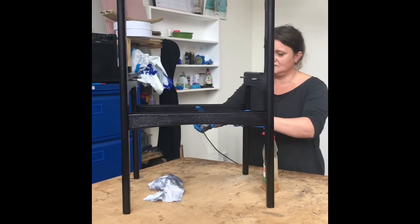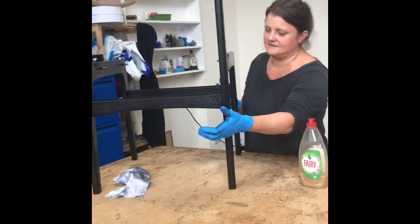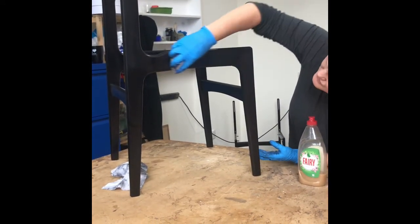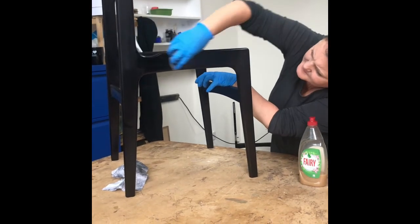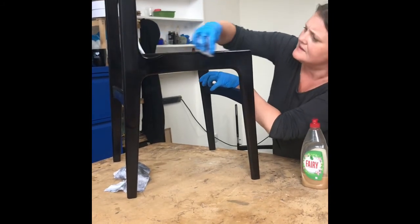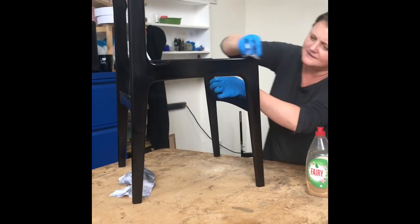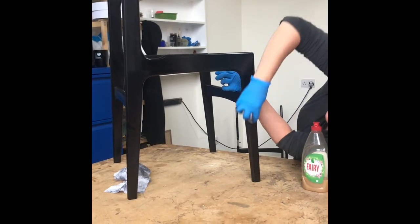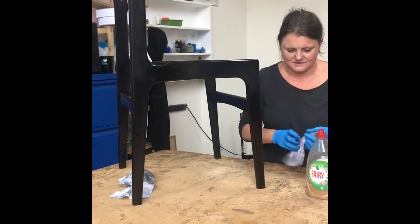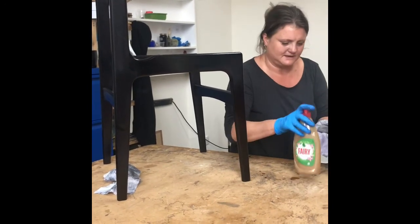And now, exactly the same as when I was brushing on, I only want to stick to one piece of timber. So if I turn it like this, I'm just going to apply the polish like that and go down, going with the grain all the time. All I want is to get a really nice satin look on that. So I'm going to polish it all up in satin. There we go. Let's give it another little load, and then keep loading. If you feel it getting stiff, just keep loading up.